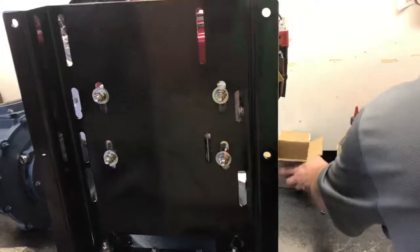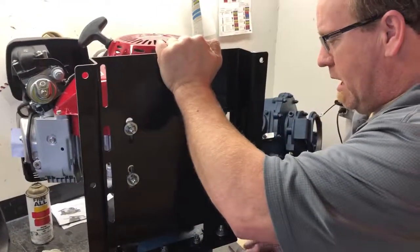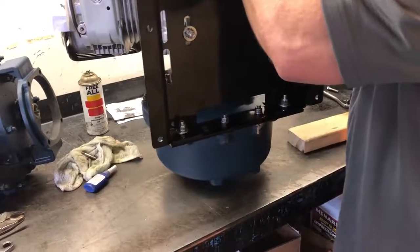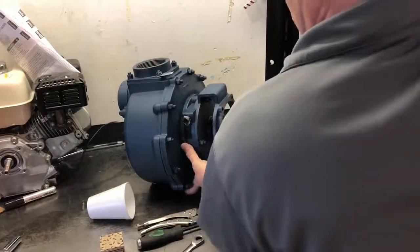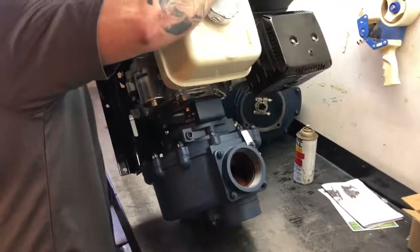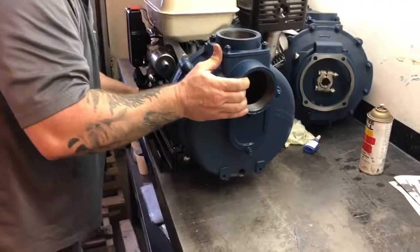It's pretty easy. I've done a lot of them. I've never had one come back yet. Now, I always put the board under here if you remember. I take that nut out, the drain plug, because we always want that out to make sure it doesn't leak antifreeze. Then your pump sits nice and level for you. So when you're done, just hold up on the plate, pull your 2x4 out. You can then spin your pump sideways. You can just set it down like that. You're not lifting this thing, you're not really doing anything, and you can just put it down without hurting yourself.